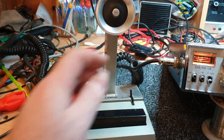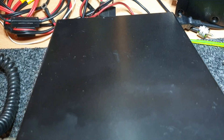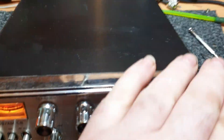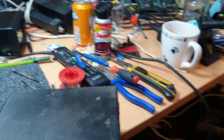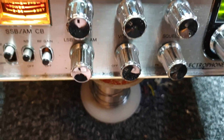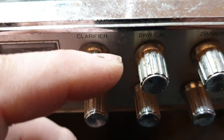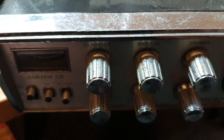There are so many of these we had to repair over the years with broken bars — this one is quite nice. Always look for the chrome top, and the reason I say that is I have over here a good example of what not to buy. The camera's going to get the right angle — water, or moisture sorry, has got underneath it. You can see it when you look at the knobs — look how beautiful the knobs are on the good one. When you see them and they look almost like rust, it's just the fact that moisture has got to them.